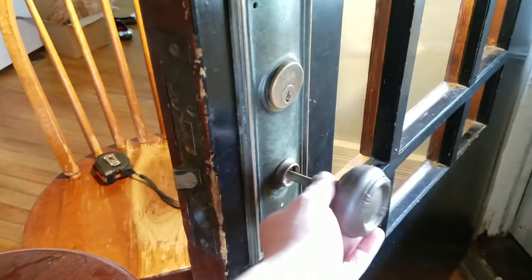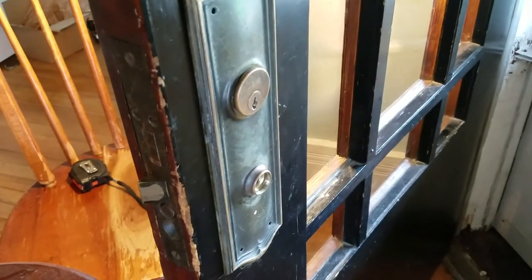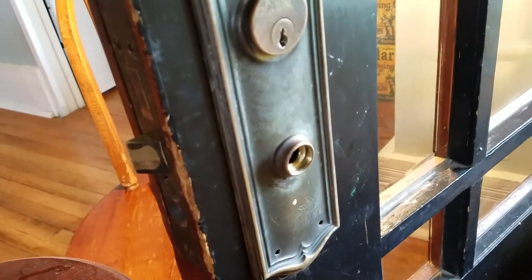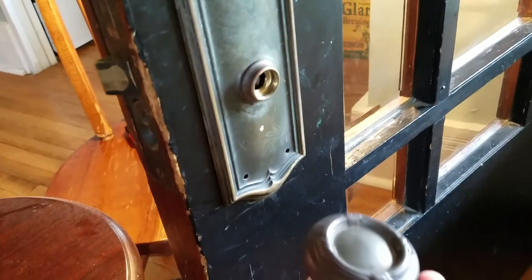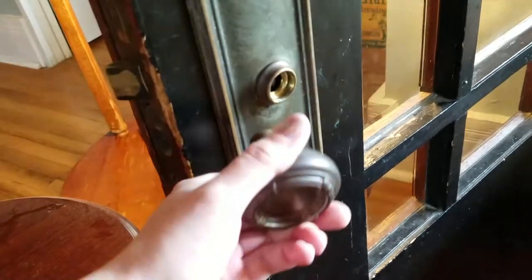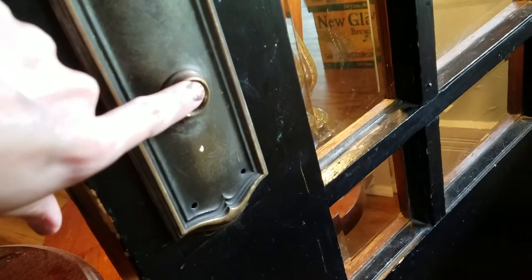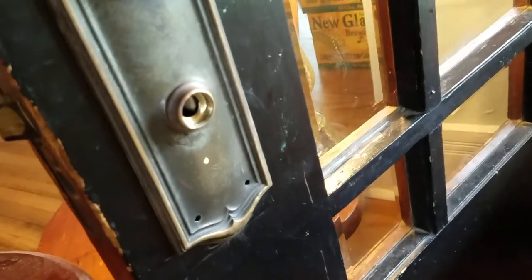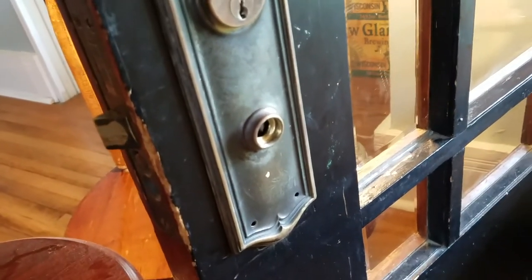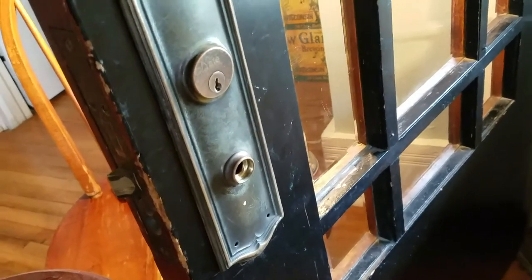So what you would do if you're going to change everything out — now that your back door knob is off, you can just slide this right out. You can see the little set screw there. If all you wanted to do is change your knobs, which is an easy thing to do if you just want to get a fresh look on your door, maybe change them out with something a little bit fancier — really all you have to do is go get the desired pair of knobs that you want, make sure that they fit properly inside this little collar piece here. If they're a little wide, the knobs I have here were a little bit snug. So what I did was took a Dremel with a grinder attachment and just went in there and ground a little bit of the brass down because brass is really soft. You just have to find knobs that'll sit in there properly without being too tight, otherwise it's going to be kind of a hassle to open your door. And I'll show you guys how to replace those as well.